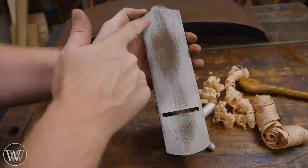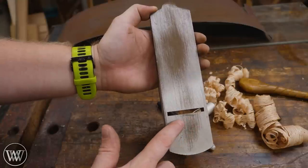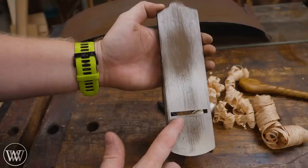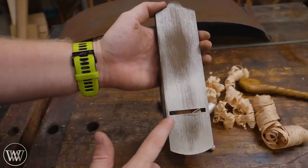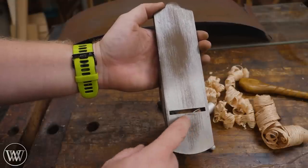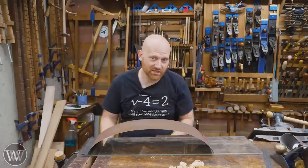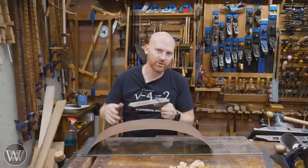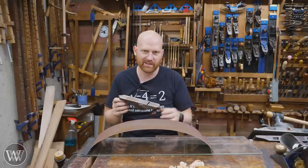After a few more passes, we've gotten rid of most of the Sharpie. There's still some Sharpie in here and a little bit going right across the mouth. At this point I may keep going until I get rid of that Sharpie in front of the mouth, but if I'm not turning this into a competition plane I'm not going to worry about it too much — because I am getting scratches through it and it is well within the variance. I'm not going to be taking shavings thinner than the thickness of the Sharpie mark. After the 36 grit, I'll go up to about a 100 grit, then maybe a 200, and I'll usually stop there. You could take a 400 and polish it, but you don't really need to.